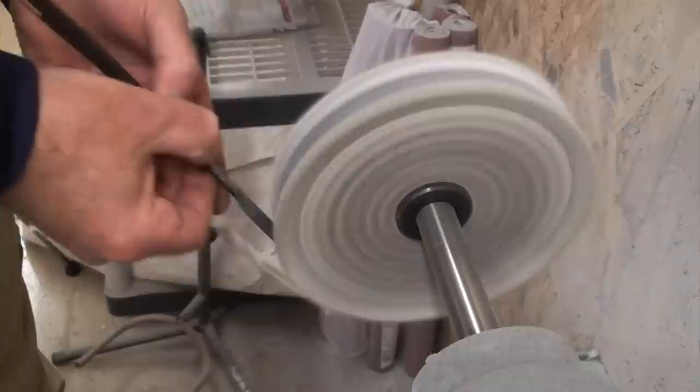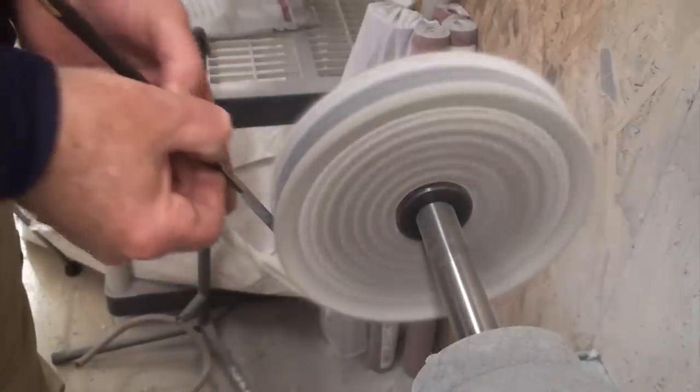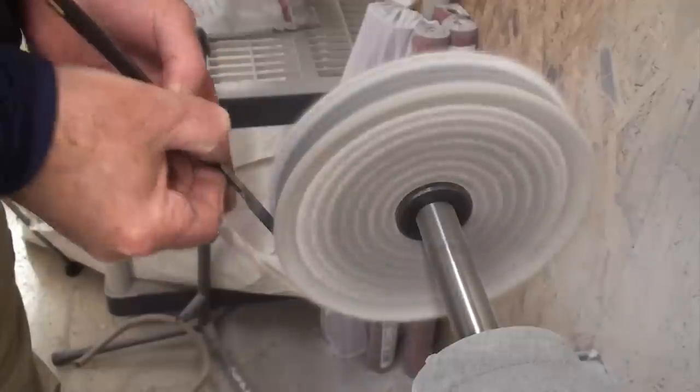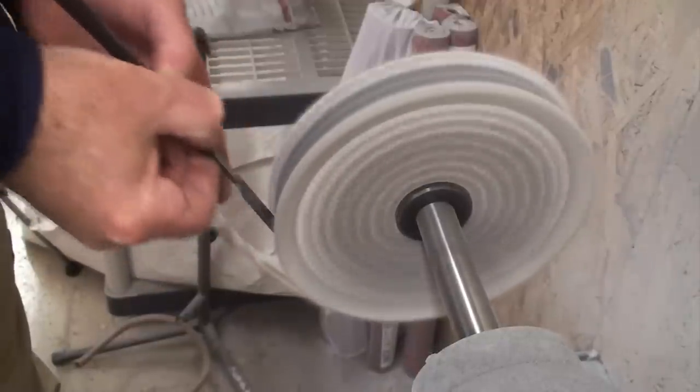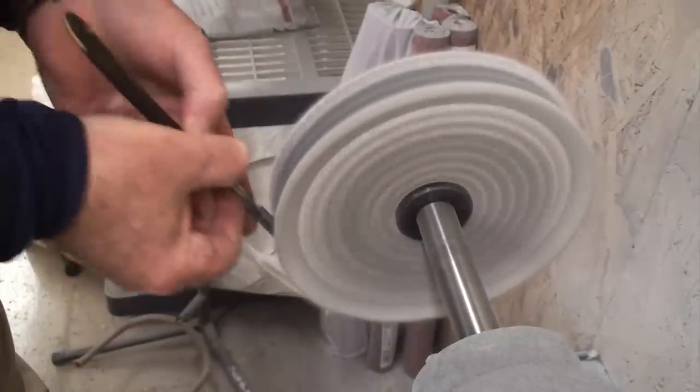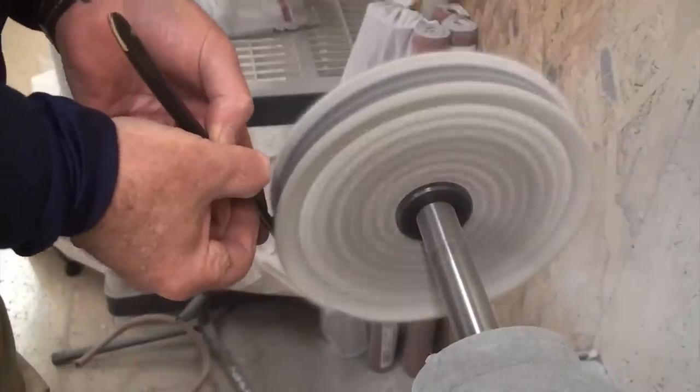Horn and wood I can actually clean up on here on the green — it should polish up really well. But a lot of the acrylics, no. Because you basically want to get to the same grit that you would if you're doing a headlight restoration. And you see — I'm not staying on here forever. There's really not a whole lot of need. I only want to do as much as it takes.